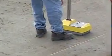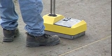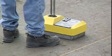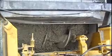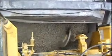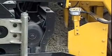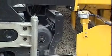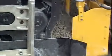The Gameco RCC High Compaction Screed provides the initial compaction necessary for uniform density and strength across the pavement. The Gameco system features two independent augers for spreading the material. A High Compaction Dual Tamper System with variable speed control provides uniform compaction. Variable control for vibration to the screed provides compaction and the finish to the surface.